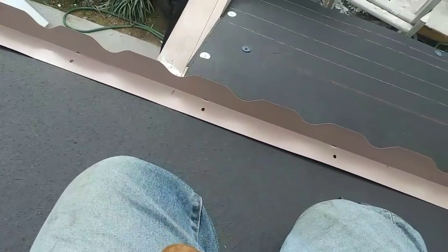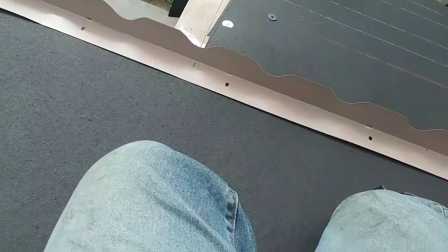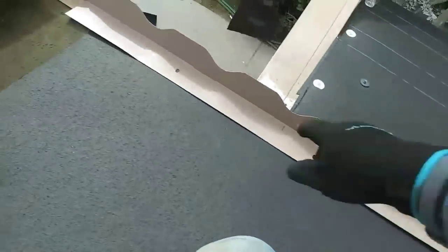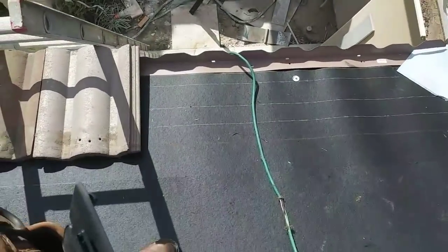I align this one exactly where it belongs — you see it, butted to the old one — and then I make a mark right here. I cut this piece straight with that, and then this piece I start from the end over there, which continues the course. When you start your new course over there it's gonna match this one. That's the only way you can do it — otherwise you'll be running in circles. You have to mark it. This little piece is the one that guides how you start over there.